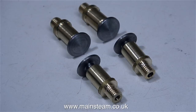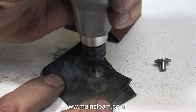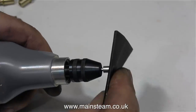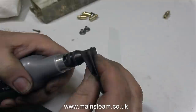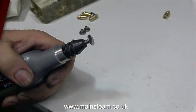In this clip, you can see the four buffers fitted into the buffer stocks. They need a little bit more work yet, but they're just about the right thickness and I think they look okay. The smallest buffers I've ever made before were for a five-inch gauge model steam locomotive — these are very small, but the principle is identical to making larger ones. Now it's time to clean up the heads of the buffers and make them shine. I'm using one of these superb Proxxon rotary tools for this job, and by spinning the buffer onto various grades of sandpaper, in no time at all I can remove all of the tool marks left from the form tool. In order to spin the buffers, I fitted a 7BA stud from an old Stuart steam engine in the chuck, and screwed the buffers in turn onto that.